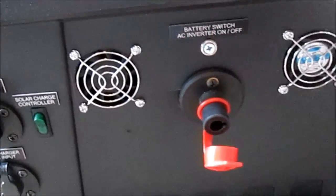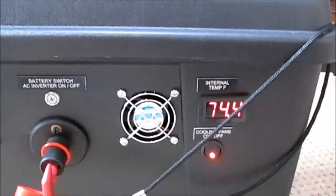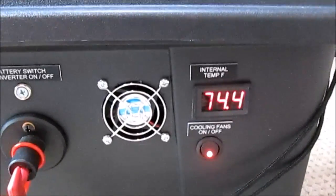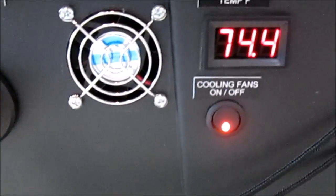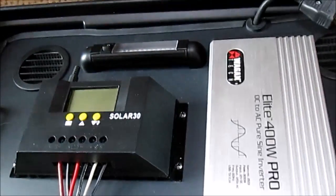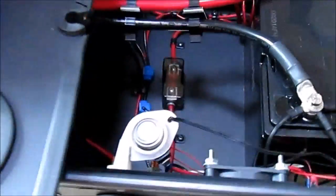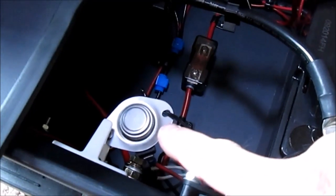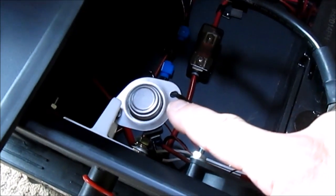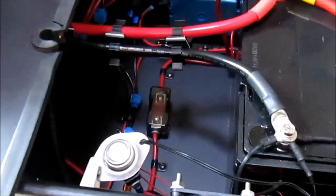Let's turn this on and I'll show you one of the things I've done to improve the energy efficiency of this system — it has to do with fans and cooling management. When I turn this on, you'll notice that the temperature gauge reads 74.4 degrees and the cooling fans on/off switch indicates it's on, however the fans are not running. That's because I've installed a snap disc style thermostat fan switch, set to come on at about 95 to 105 degrees and go off between 75 and 85 degrees, automatically controlling the fans and saving energy.